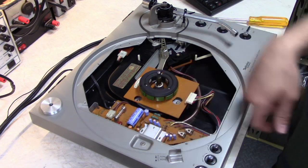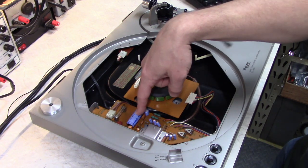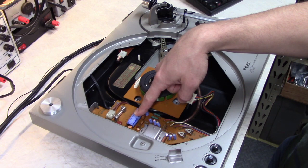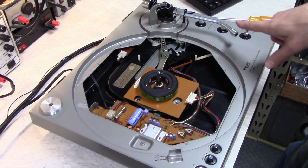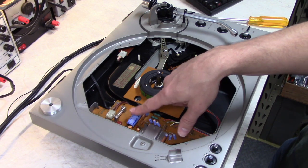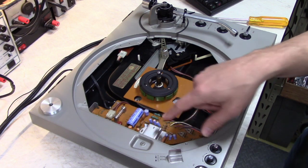This is a fuse — that should not be a problem. This is the one big capacitor on here. I might replace this — I've noticed some hum when I turn this turntable on that's being picked up by the cartridge, and I suspect there's some noise on the power supply. I'm going to check for that and see what the condition of this power supply cap is.